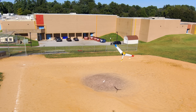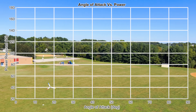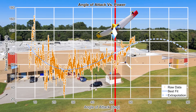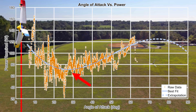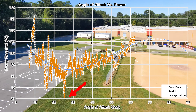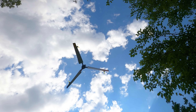Now let's get back to that data I collected to see how much power it takes to fly in forward flight. I didn't bother to add any way of measuring airspeed, so instead we're going to look at power draw vs. angle of attack to maintain a constant cruising altitude. As we start to pitch over into forward flight, you can see there's a clear minimum — this is basically where the vehicle's lift-to-drag ratio as a whole is maximized for most efficient forward flight. This is a very high angle of attack, so the wings are definitely stalled and not at their most efficient, but that's almost expected since I primarily geared this design towards spinning efficiency, whereas forward flight was a secondary goal.